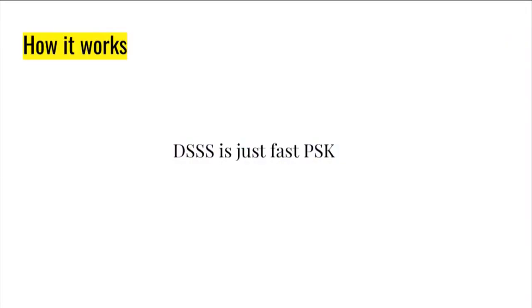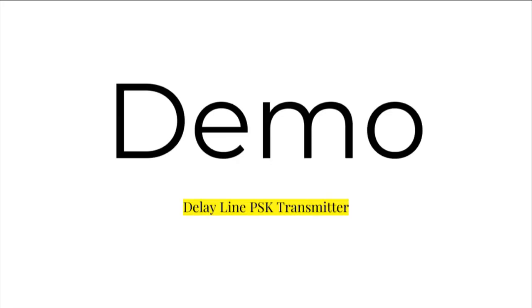Okay, so we are now transmitting a binary phase shift keyed signal in the 2.4 gigahertz band, and we were like, what target device could we use that uses 2.4 gigahertz and has binary phase shift keying or QPSK? And we said, hey, Wi-Fi. So if you're in the front couple of rows anywhere near about here, you might be able to pick up a Wi-Fi beacon that we're transmitting. And it says, "is this revolting enough for you," I believe, is the network SSID.